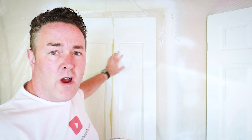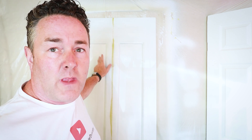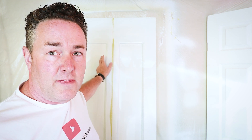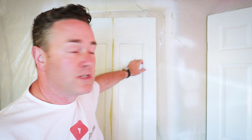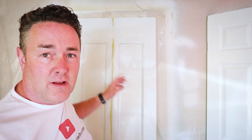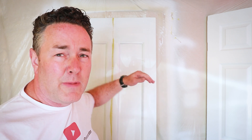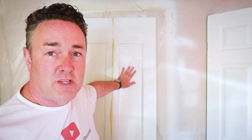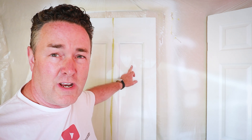We're back - time-wise I've been a bit less than four hours. They're both nice and dry and I'm quite happy to coat these back up. The Benjamin Moore ScuffX was dry before the Aqua Guard - the Aqua Guard was just hanging a little bit wet into the panel moldings. With the ScuffX I've found within about 20-25 minutes after coating up it's actually quite dry and hard to touch. The Aqua Guard hangs a little bit wet longer, but you can still get two coats on in a day.